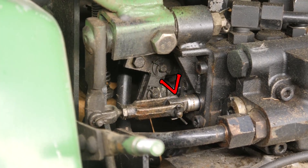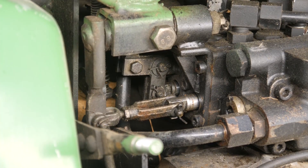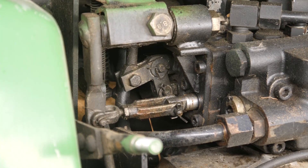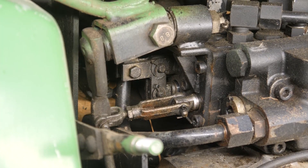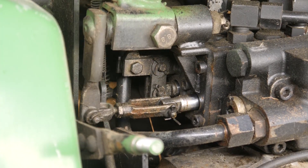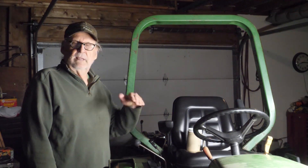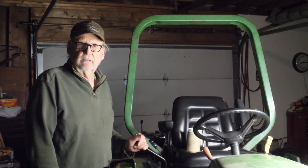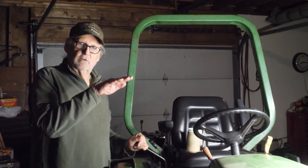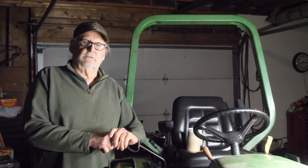The slight rounding of the hole in the valve will be ignored. Note that both axes on this control had passed what I'd define as medium wear. Depending on how remotes were used, you could have major wear on one side and little on the other — say the loader was mainly used for pushing and backfilling rather than tipping and dumping. Or running a snow blade with an angle set, most of the time you'd just be raising or lowering the blade. Depending upon the application, some parts of the system may have more wear than others.